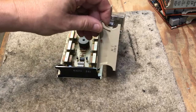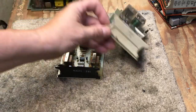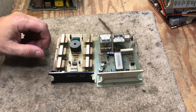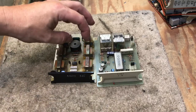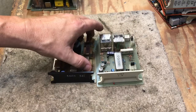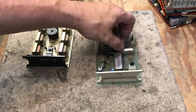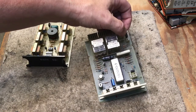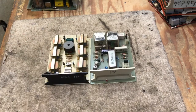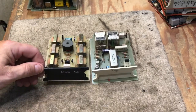Here I have a very old ITT K400E — it's still common; the newer one just had a black handle on it. The K403 and K400E were intended to be used together for music on hold. You would wire up two wires from the K403 to the line card at the 66 block — one side connected to the tip side of the line, the other to pin 18. On each line card you would set a strap to allow music on hold. This was a fairly easy thing to wire up if you had the proper mounting for the 403.